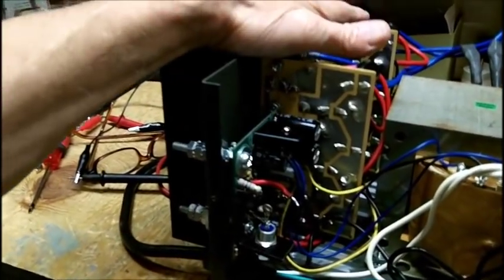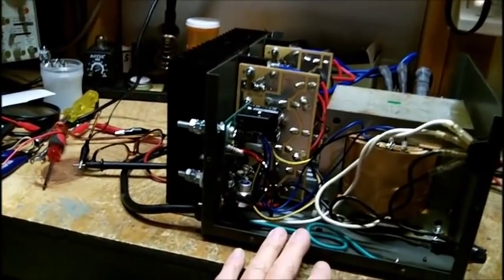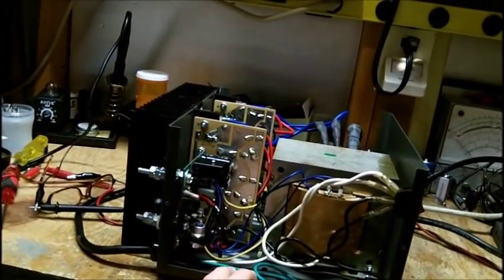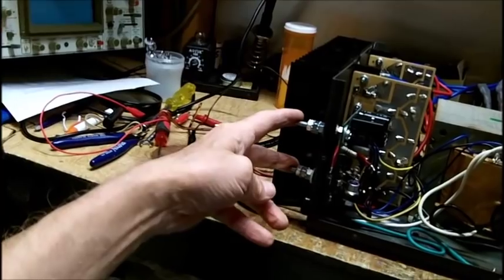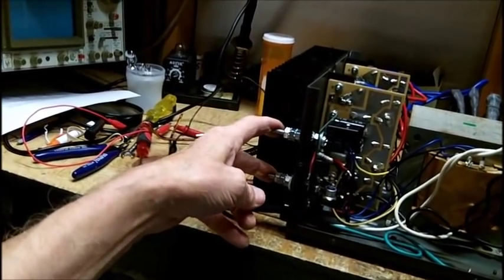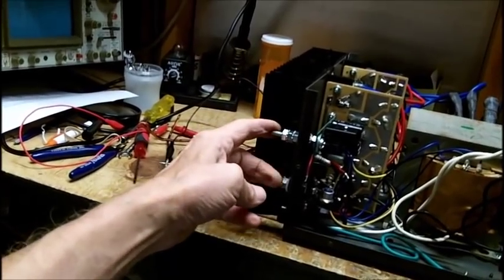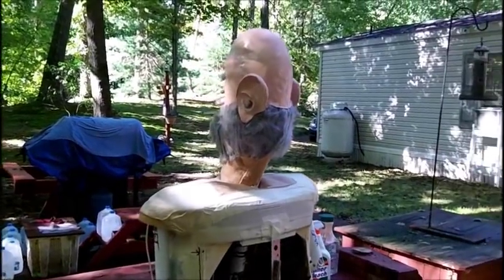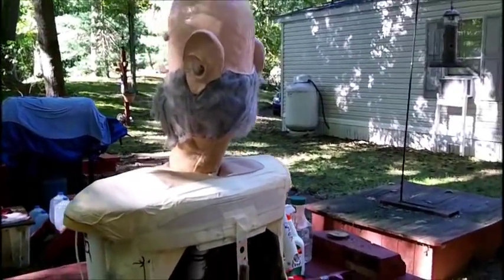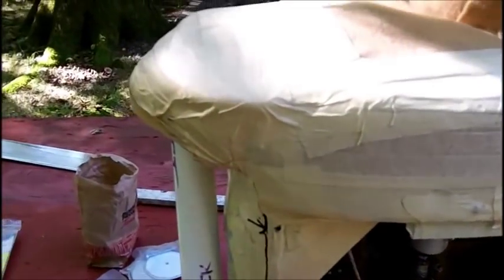It is, as far as this end is concerned, but with 71 volts coming in here from the line, from the variac, I'm getting 13.5 out of here. And I didn't even try to push it up to 115, 118. It would probably be 23 volts coming out of here, for all I know. So it looks like Uncle Dorkel's going to have at least his right arm working.